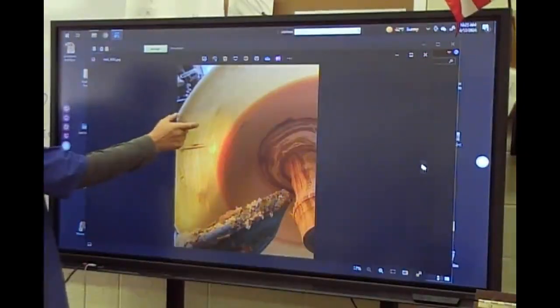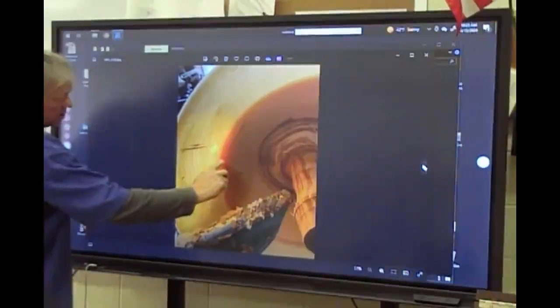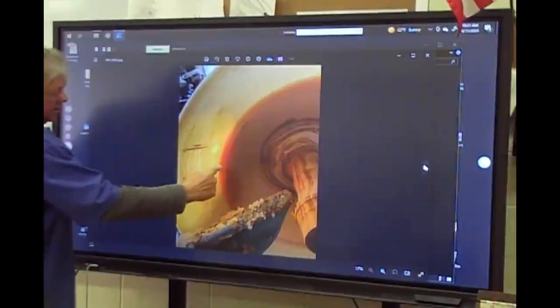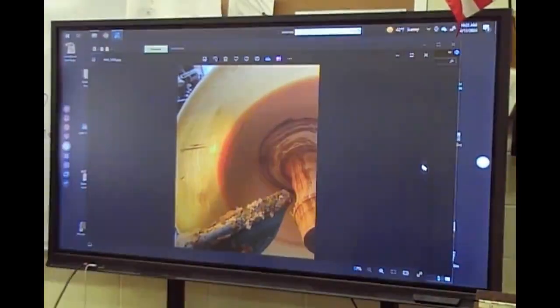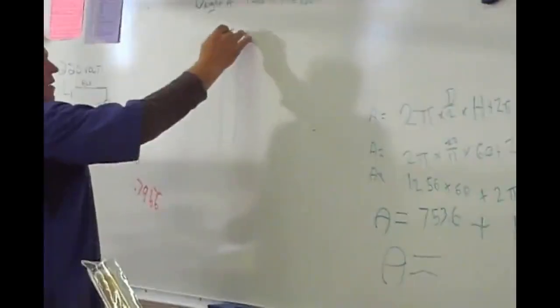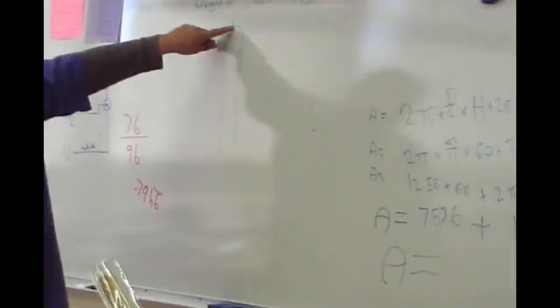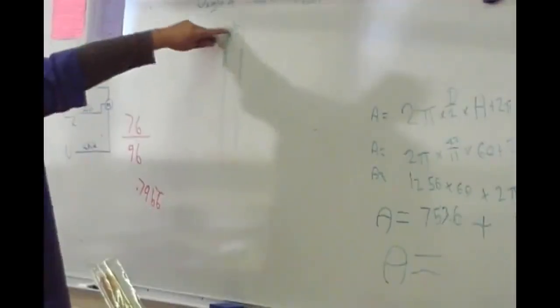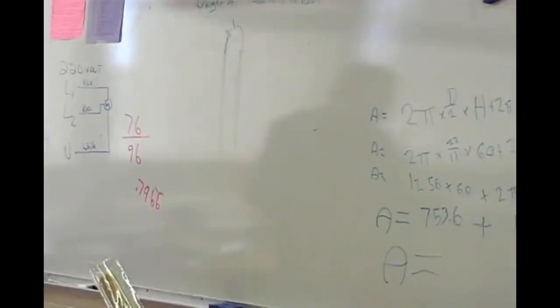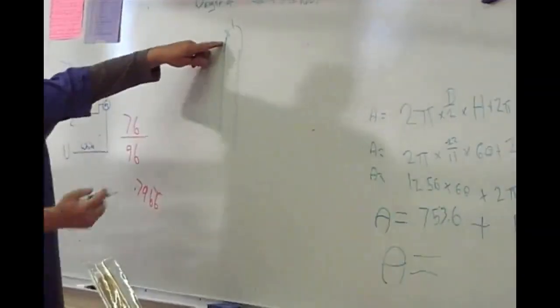I did this inch first, then this inch. This is probably a quarter inch thick where it's this brown color — it has to go down thinner. I'm going to cut from here to here and bring this next inch down, pulling and going back — cutting toward myself with the gouge. I'm doing my cutting between what I'll call 11 o'clock and about 9:30 or 10. If I start cutting over here, it's too much drag and it breaks — too much cutting edge touching.